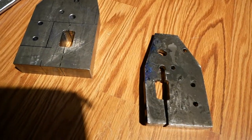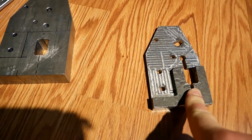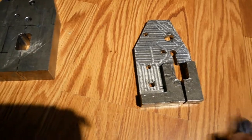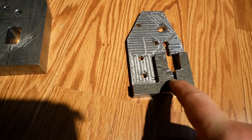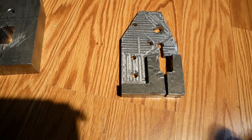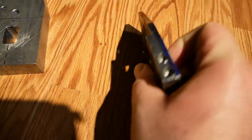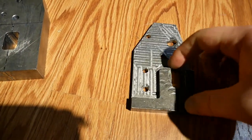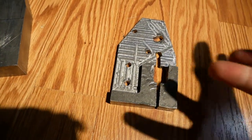I also had a weak spot — those two bolt holes worked fine, that part never came loose, and in fact when it would start spreading, those two screws were the only thing making this torque arm survive. But up here there's only about a quarter inch worth of steel, and then nothing above that. So of course that's where all the stresses were, and that's the part that spread.